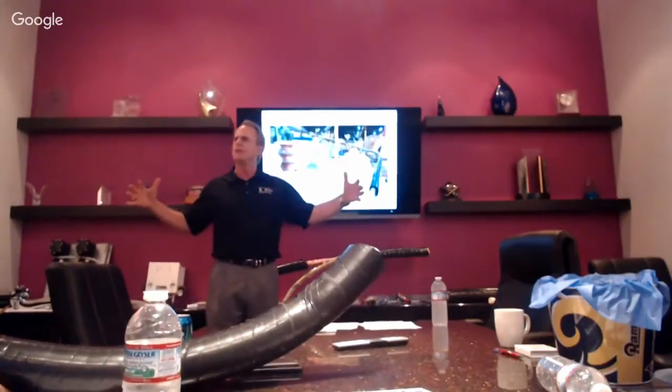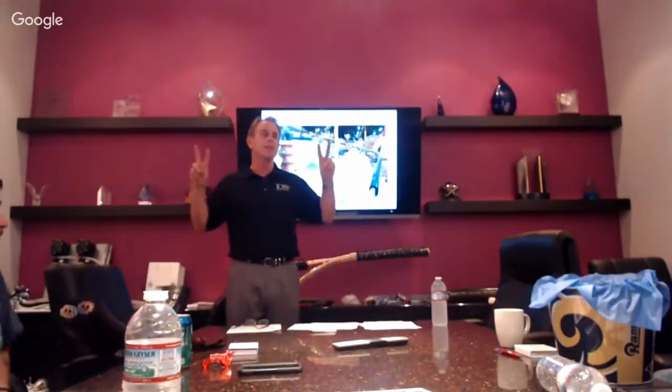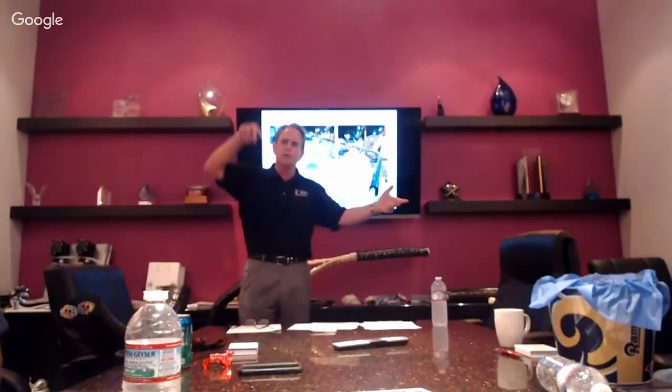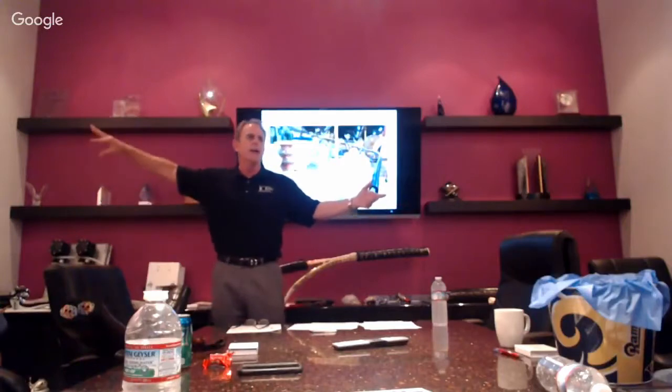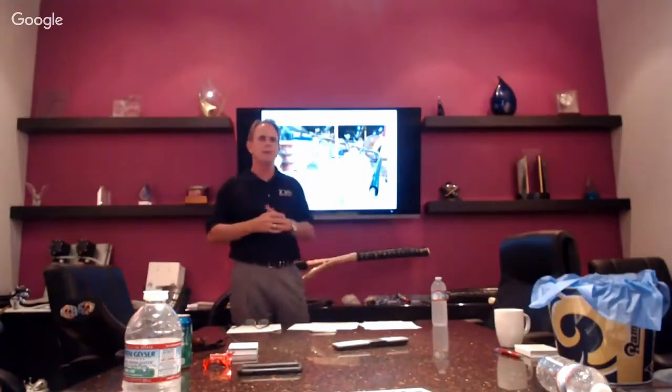Where it's most important is in the stadiums, where you have 6 2-faucet towers on a front counter. So what they'll do is they'll create a manifold. We'll start with 6 towers with 2 faucets each. So we have 12 lines coming in, and they just split 2 here, split 2 here, split 2 all the way down to the end. And then you bring in the main line and you tie the 2 together. Or it can all be one piece and you just work backwards. But most of the time they come in different pieces.